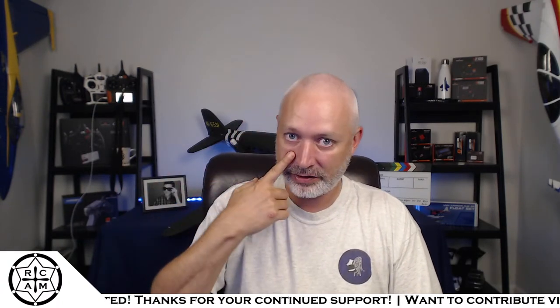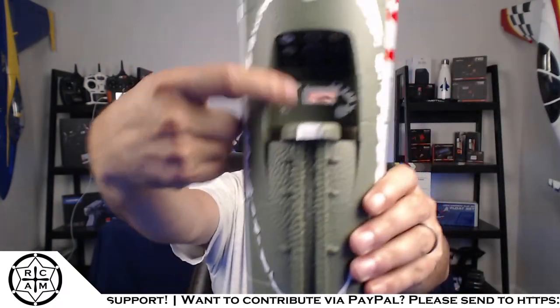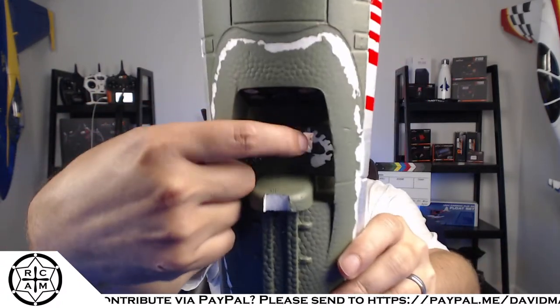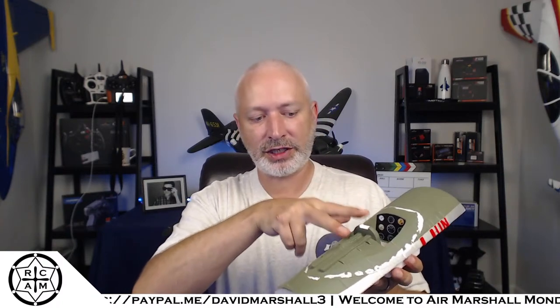So I'm doing pan only. I'm only doing pan, not tilt, and that's what the hole in the bottom is for. I've already cut that hole to fit a 9 gram servo in there, and I want to get the VTX and the antenna mounted first.